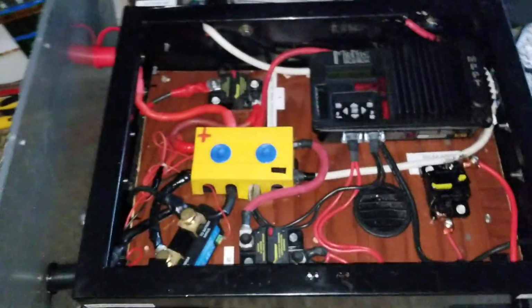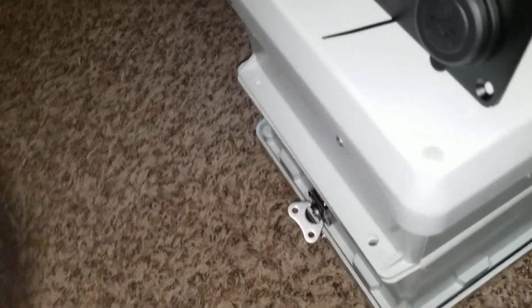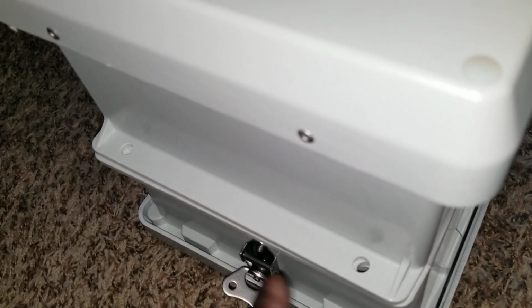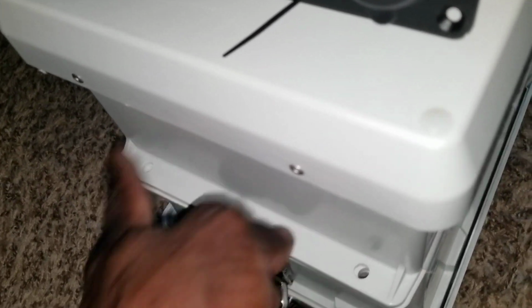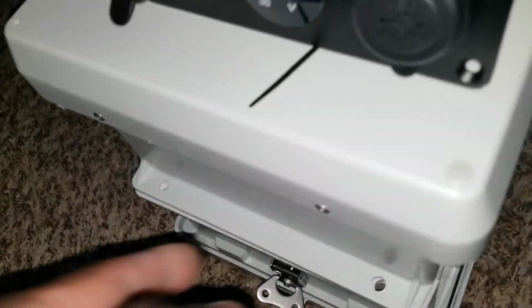Then I can do jumpers on the side, positive to positive here, negative to negative here, like those terminal connectors, just like this guy here. I have those on my portable generator right here. So I can do that and just get the wires in and connect out. But I want it to be a clean setup, so I put the terminals here, both positive and negative, so I can just take the jumpers right there, hit this guy here, this guy, hit this guy right here. So when I'm going somewhere, I can disconnect the wires and just leave the terminal position there.